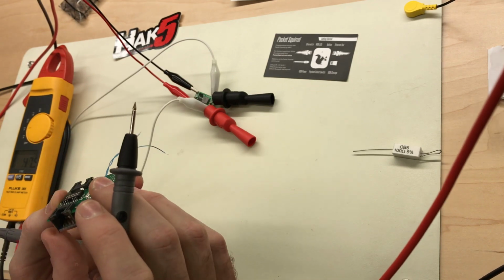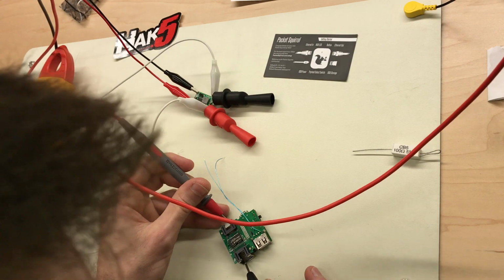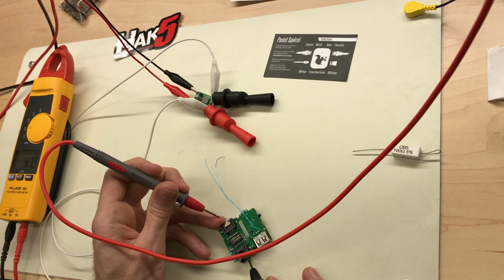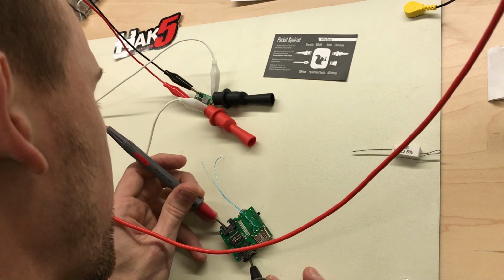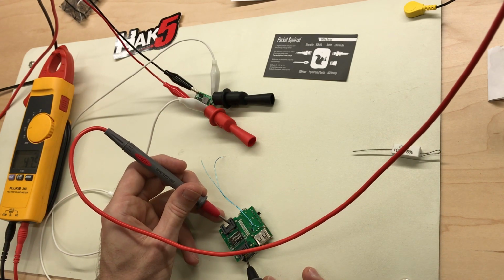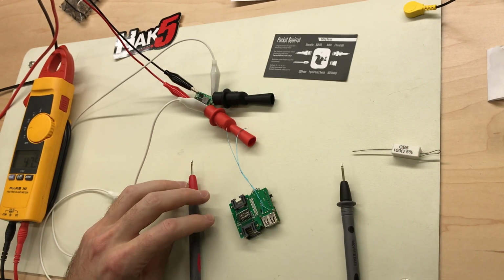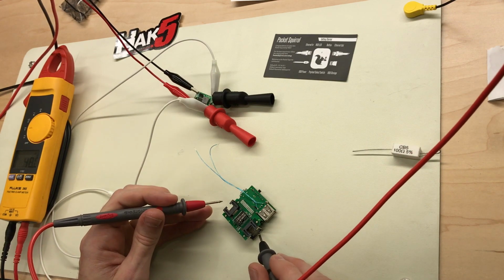You check that by seeing if the POE pins are connected. And it does not appear that they are. Four and 5. Now, the POE pins are not connected, so this little squirrel will not pass POE, it looks like. Unless it's going through something that the continuity meter is just not pushing through, like a diode, maybe.